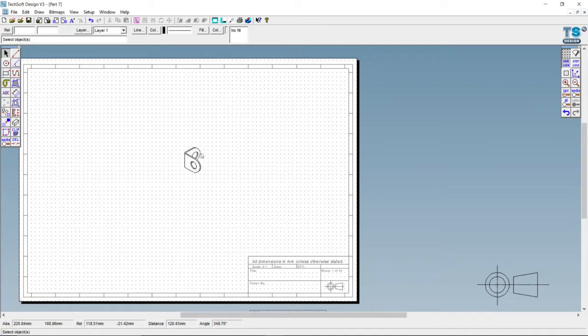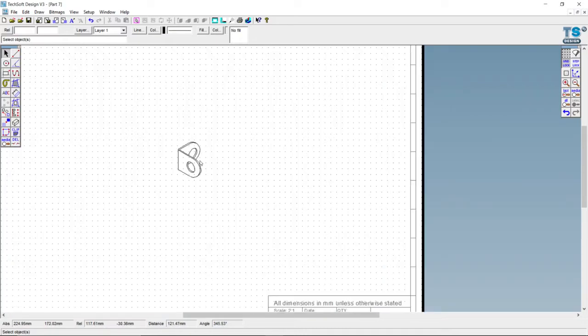I just feel when it comes to doing the orthographic projection, that it should be done in the correct orientation. So the view from above will be that way. That's going to be a thin L shape. And the front view, that's going to be the side view going in that way. So we're looking at a half oblong piece there with a 4mm hole, and then a front view going that way, nearly identical, slight differences in the dimensions, but we'll get to that once we get started.